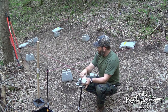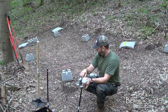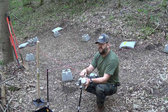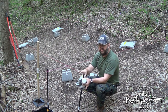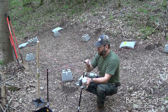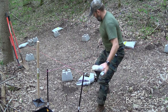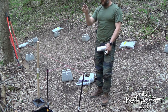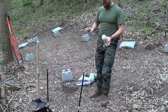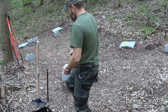I want some uplift protection, so I'll probably dig to 42 inches — six inches need to be above the ground, three feet is 36, plus 6 is 42. So let's dig three feet. I'm going to measure three feet on the shovel and mark it with a Sharpie just so I have a quick reference. Doesn't have to be perfect — let's dig three feet, tamp it with the tamper, and then put some gravel and a couple inches of cement.